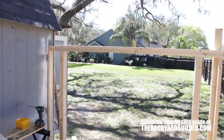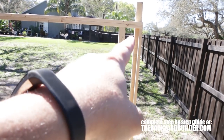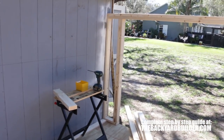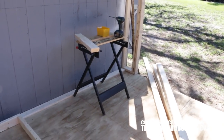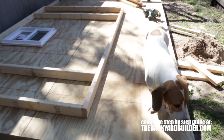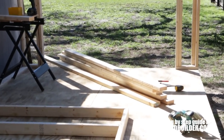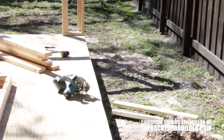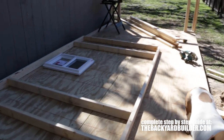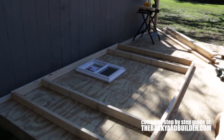It'll be a basic roof with a slight slope, but your head height needs to be the lowest point which is over here — so 63 inches plus three inches on the double header plus an inch and a half on the bottom plate gives you your total wall height, which is not quite six feet, so it's going to require crouching. I have my two by four stock up here, I cut off to the side so all my scrap falls down, which I'll use to frame in the window, and I build over to the left.